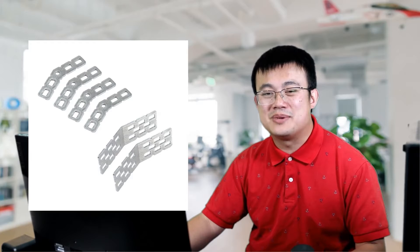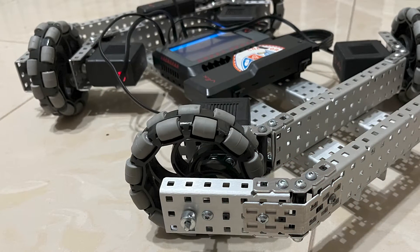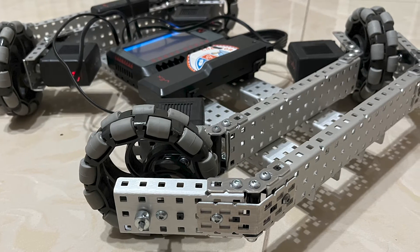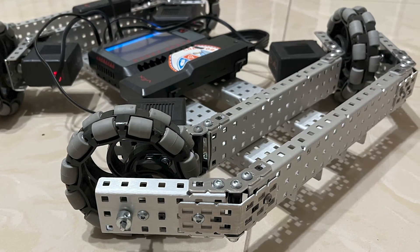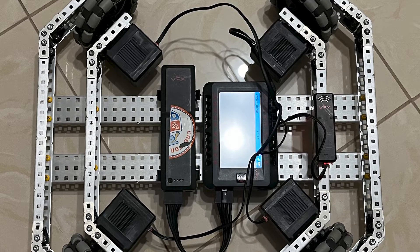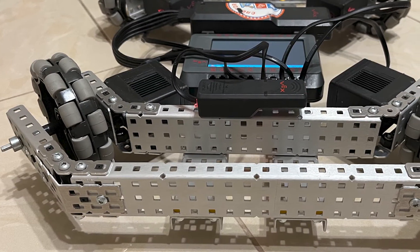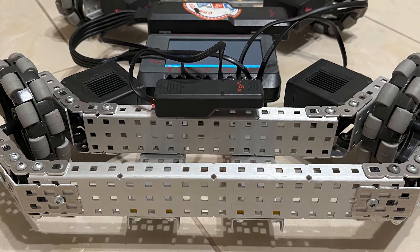To build this xDrive, you will need several sets of 45-degree gussets. By keeping all the omni wheels at 45 degrees, you will ensure that the base moves in all directions with the same amount of power. The outer channel and the inner channel sandwiches the omni wheels into place, keeping the wheels protected from impacts while maintaining stability of the driving base. Making sure that the base is stable is a big priority with the xDrive, because even a slight change to the wheel angles can affect the accuracy of the drive.